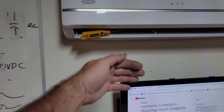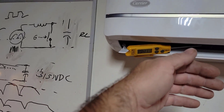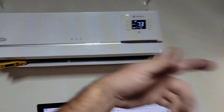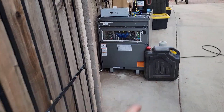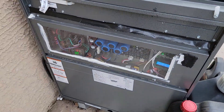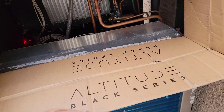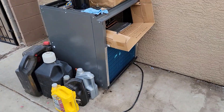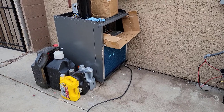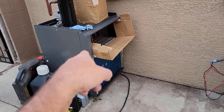It's cranked up to 114 degrees discharge air. It does seem to back off a little once it starts recirculating some air out there. I added a piece of cardboard as a makeshift splitter. All green lights, no fault lights — that's good. It's pretty mild outside, probably just above 60°F — got into the low 70s for a high today. So even if it recirculates a little bit, there's still a lot of heat in this outside air.